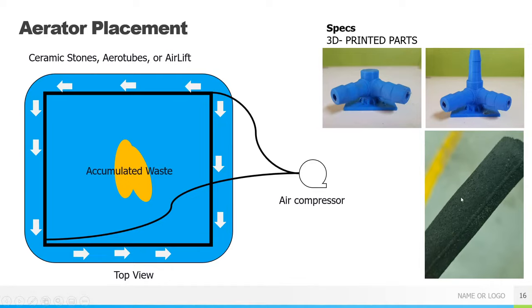These are actually perforated tubes whereby once you pump air through, it creates what we call a diffuse air bubble throughout the tube. So it's just like an elongated air stone, but of course it's flexible. All right, so how do we connect it is through the air compressor. We split the lines into two points, right? For example, this point, and the air will travel through this perforated rubber hose. So it travels both ways, and another airline will be introduced at this point, and the air will also travel in this direction. Actually, this is wrong. This arrow should be in the reverse direction. So basically, it's providing air throughout the perforated rubber hose and providing aeration.